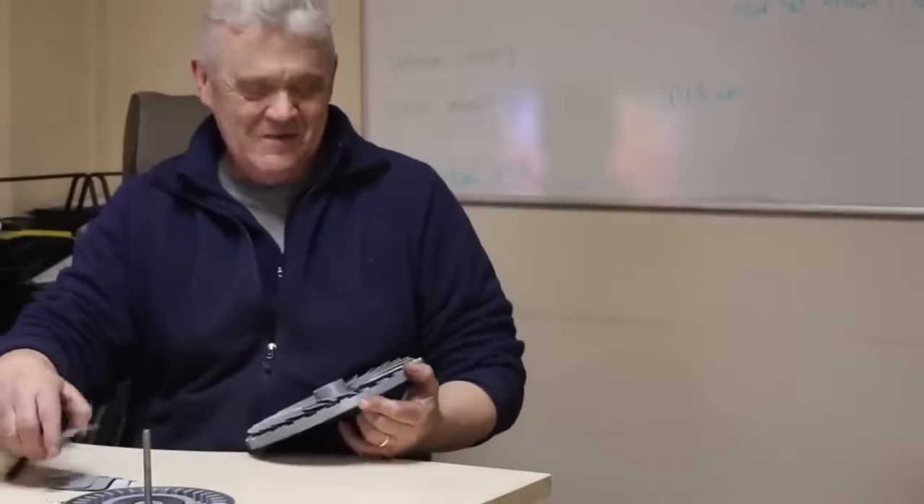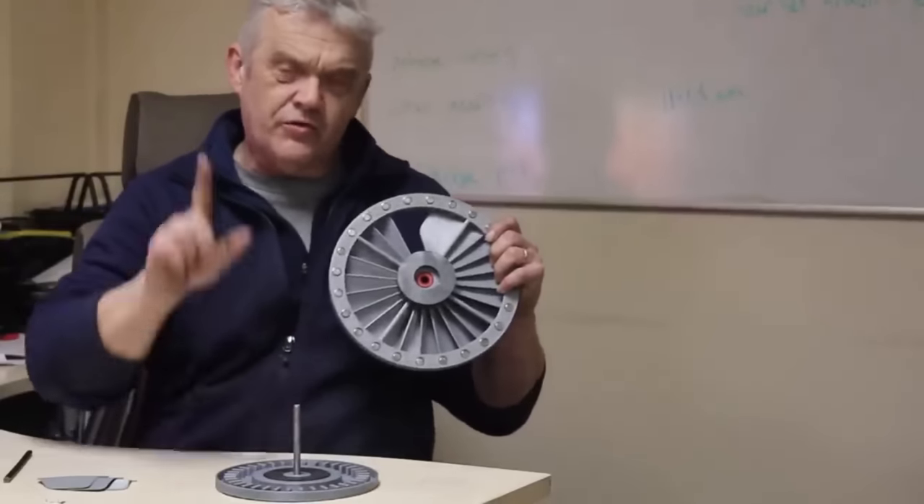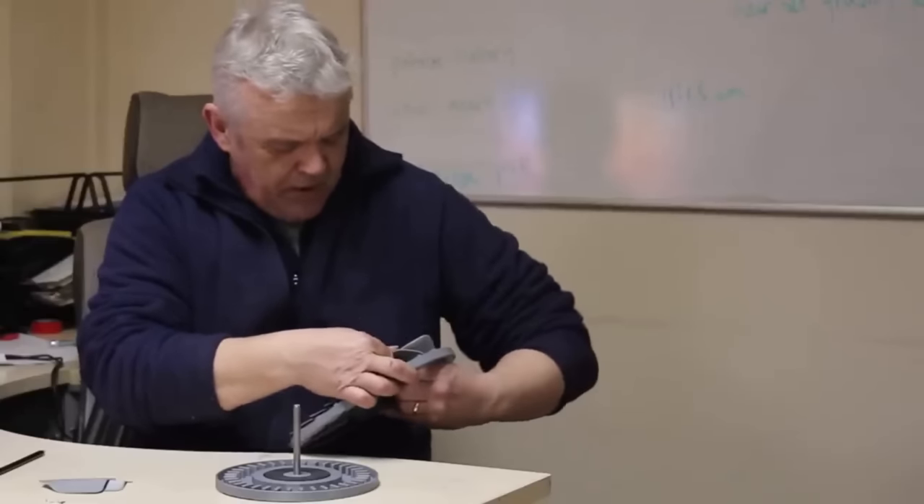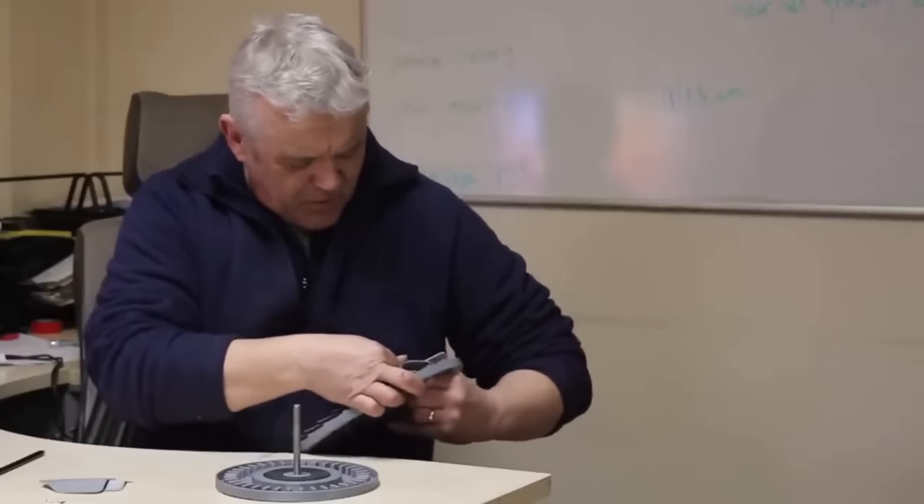I've replaced my feathers with his feathers and we're going to stick those all the way around. If you saw video 1864 — the original feather — and video 1874, only ten days ago, you'll know that we have a third idea to incorporate. The first idea is feathers to reduce resistance, the second is generation at the rim, and the third is magnetic levitation. I've put a ceramic ring magnet here — you can get these from speakers, although I bought mine from Amazon — and on the base there's another ceramic ring magnet with north facing up, creating a magnetic bearing.